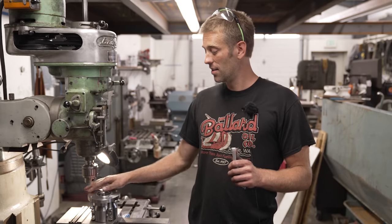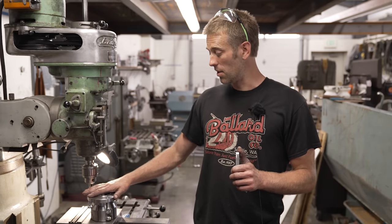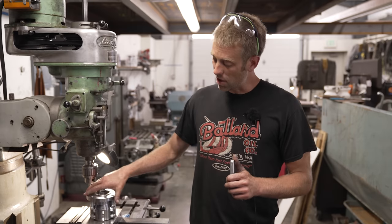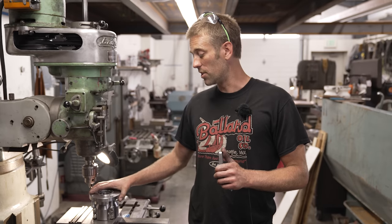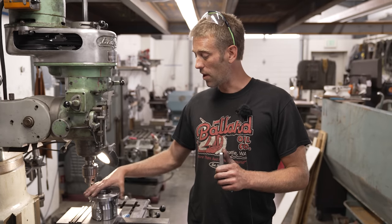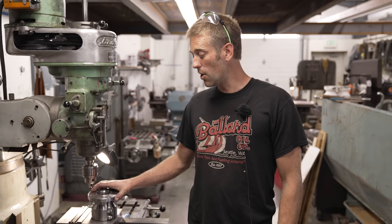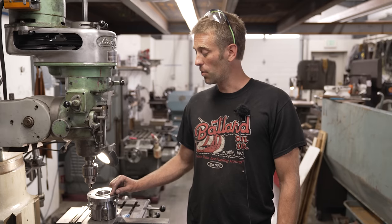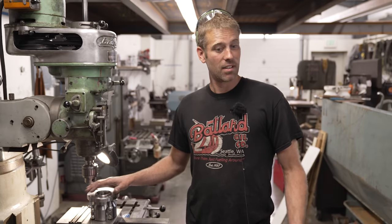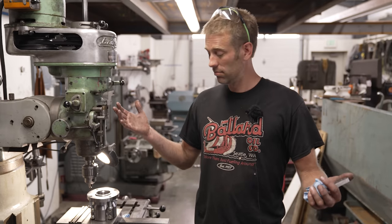The next step is to chuck the coupling up in the mill, in the indexer, and drill for our set screw. And our set screw will just capture the coupling's fore and aft orientation on the shaft. And even though it's not absolutely necessary, because this is a soft mounted drive line, we're going to fit and face this coupling in the lathe. And it's just easy. We've got the tools here, so why not?